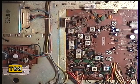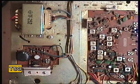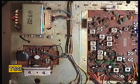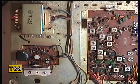What I've decided to do — I don't like the look of some of the capacitors in this power supply, well that one for a start. So I'm running it on the 12 volt, or 13.8 volt, bench supply rather than plug it in at the mains. It just looks a bit scary, and we'll get the set to work before working on the power supply.